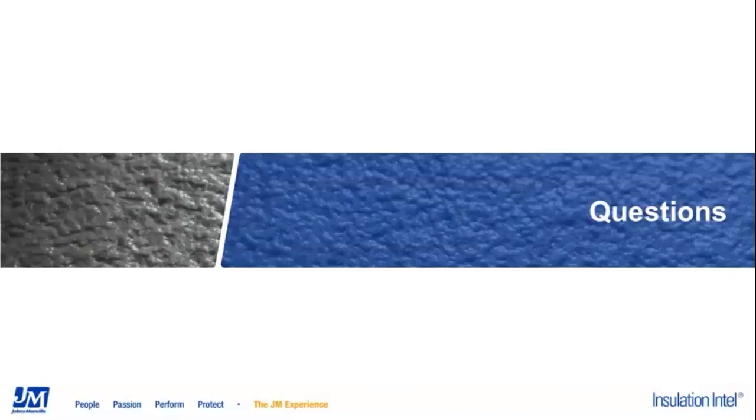All right. Does the seasonal temperature change anything in the mothballing process if it's very hot or very cold, for example? Should not. As far as temperatures, obviously, the material in our drum and in our lines, when we're first trying to get material from the transfer pump and we're pushing air through to push the ISO back into the drum, if the back of that truck is down in the 30s, 40s, 50s, the material in those supply lines is going to be awful thick, and we may have a little bit of trouble getting that moving.